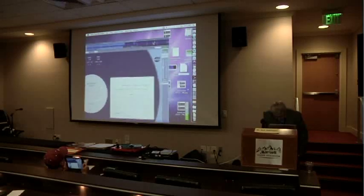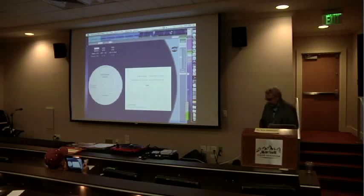I had a slide here for the RIAA, but basically, when LPs are manufactured, it's not just a matter of simply dumping the audio onto the master lacquer and then creating the LPs from that. There's an equalization curve that's applied that boosts the treble and cuts the bass. The treble boost is designed to improve the signal-to-noise ratio, because when the LP is played back, you apply a treble cut, which flattens that out. Likewise, you apply a bass boost. The reason for the bass cut in the manufacturing process is it allows the grooves to be located closer together on the LP surface to put more information on the record.